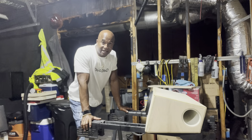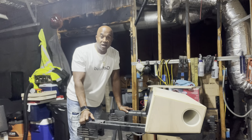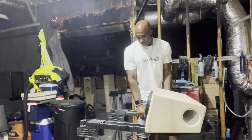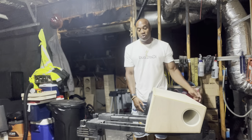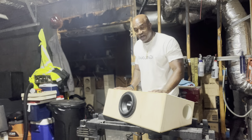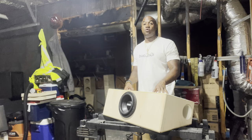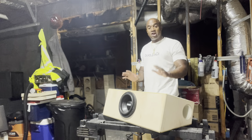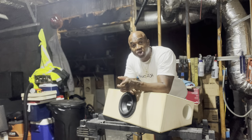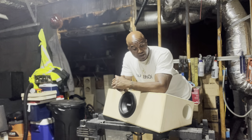Some subs have a very, very low displacement. Like I've got a dual Neo box that I offer where you can get the subs and the box from me — my number's in the description. This particular design, I want y'all to look at it. It's very nice. That's the port. I'm not going to give you the dimensions — figure it out for yourself, you have a box builder. You can get it from me, ready to ship. I can make it work for any single 8 out there, no matter what it is. One cube, with a 4-inch area port. It's very simple. I love the aesthetic — I love the look of it. This is something that can go up under your mattress, in your bedroom, in your college dorm room, in your daughter's car. You need to have at least 34 inches wide because based on what your woofer is, I need to have a certain amount of loading.